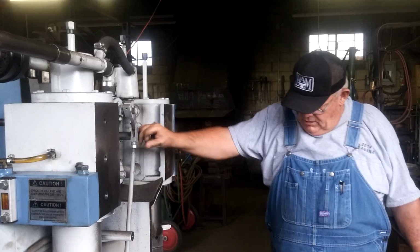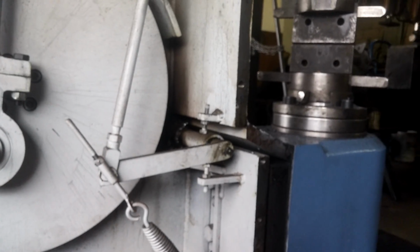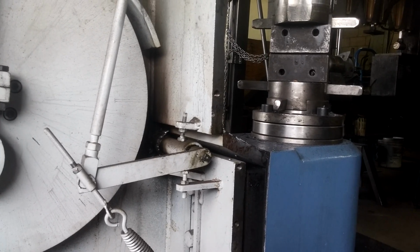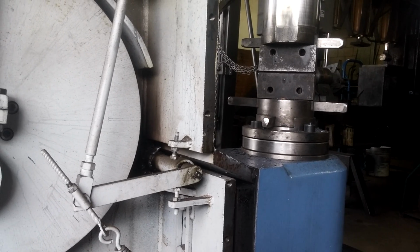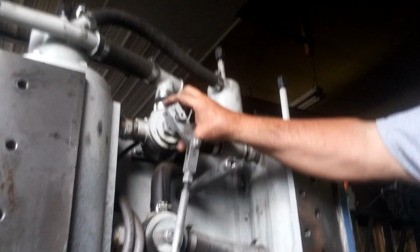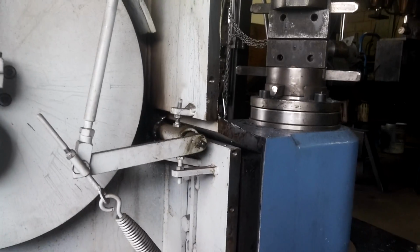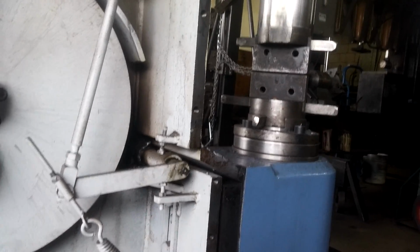Okay, thank you. There are stops here on the treadle that you need to adjust for your treadle position and to ensure that your valves are fully opening but not going past open, because it is possible to over-rotate this valve and go to a smaller hole. So you limit the travel of the treadle with this, but it also has to do with whether you get an efficient opening in your valve. And the end positions of this should coincide with the 2 center punch marks on the top of the valve that we put on. That's correct.